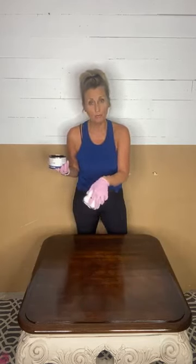Haley's on here — we're waiting on a balloon lady to deliver a 12-foot balloon garland for Harlow's birthday party tomorrow. Tammy, yes I will top coat over it — it is oil-based. You could use satin, but I'm going to use Gator Hide because this is a table that sits between her couch and love seat and gets a lot of use. You need to wait three to five days for the stain to cure before you top coat it.